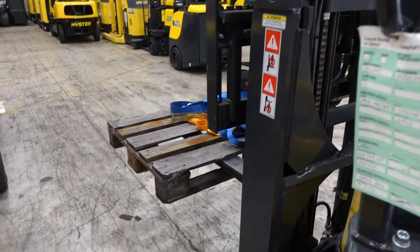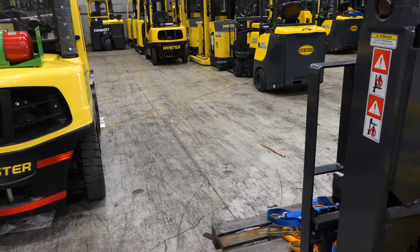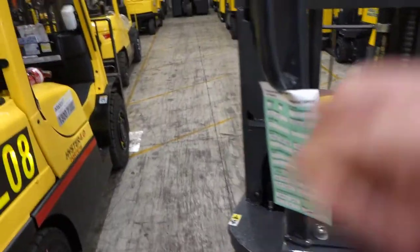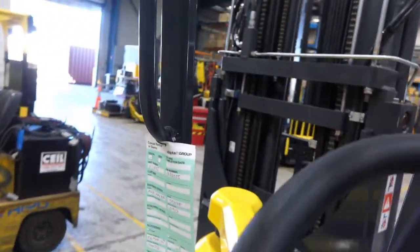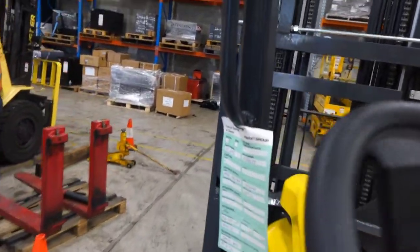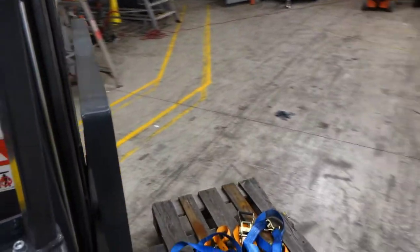The lift was super smooth — everything about this forklift was really smooth. Some forklifts feel very clunky and crashy, but this one worked really nicely. One of the other things that really surprises you is how maneuverable the forklift is. That mast when you're turning will actually turn past 90 degrees, so it's like you're turning back on yourself to a certain extent. The other thing that's very different is that this steers with the front wheels, like a car, so unlike a counterbalance forklift with rear-wheel steering — which feels a little bit odd until you get used to it — this one feels completely natural.